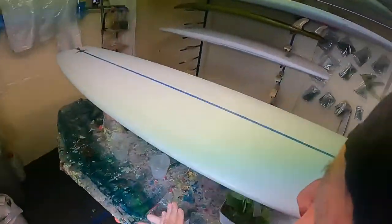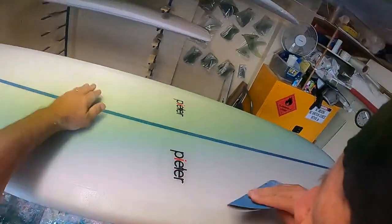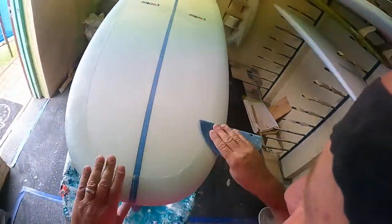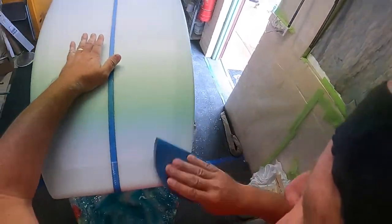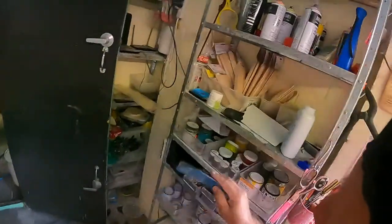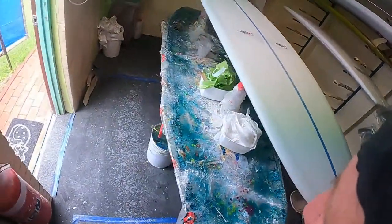Always talc your hands whenever you pick a board up if you're not using plastic — it'll help your hands. Now I'll just go around here, just a light rub. Because if you get a little fragment sitting up, it'll be like a razor blade. Just a little sharp pieces sitting up on a board like this will cut you like a razor blade.